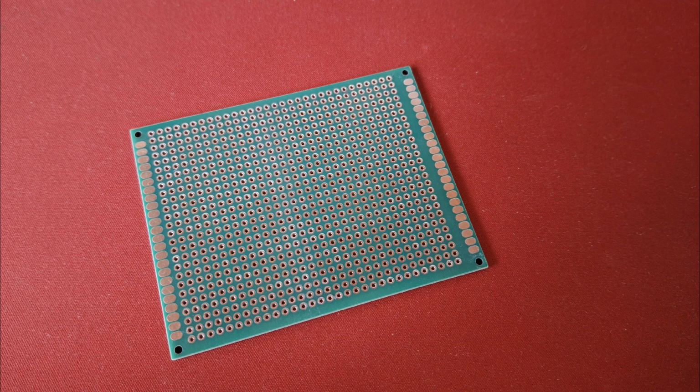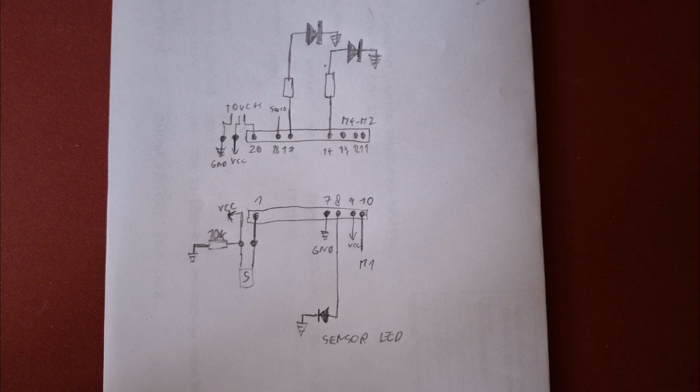The last task on my list seemed like the easiest, but it turned out to be the hardest and most frustrating. I couldn't use my CNC, I didn't want to order a PCB, so I had to solder everything onto a universal prototype board. The first issue came when I copied the schematic from my breadboard. On the schematic I connected a resistor to the wrong leg of the photodiode, which cost me nearly a whole day of debugging. I kept measuring voltages and swapping photodiodes until I finally rebuilt the circuits from scratch and found the mistake.